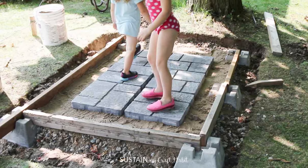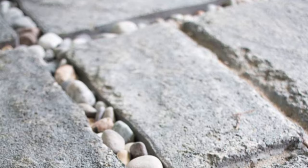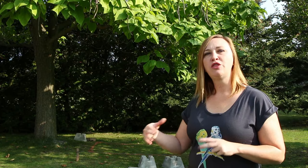So what we're going to go with now are paving stones. We purchased 16 by 16 inch paving stones to lay down, and decking cement blocks for the corners in which the posts are going to be put up. In this way we don't need to mix cement and wait for it to cure — we're hoping to get as much of it done in one day as we can.